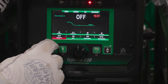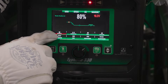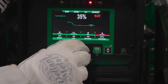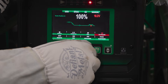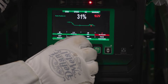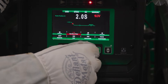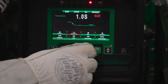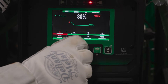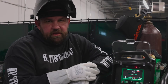You also have a remote setting — we'll visit that in a second, there's some pretty cool stuff you can do with that. Standard stuff: hot start, got it at 80%. We got our start time at half a second, running 80 amps, and we're running 35% arc force. You can go up to 100%, down to zero. 7018 tends to like about 35% for me. Hot start timing can go up to two seconds, down to nothing — we'll go back down to a half second, that's been working really good for me today. And then of course your hot start percentage, up to 100%, down to zero.